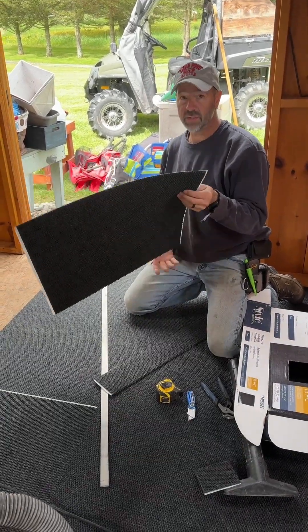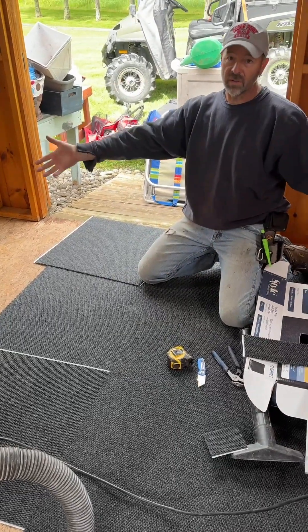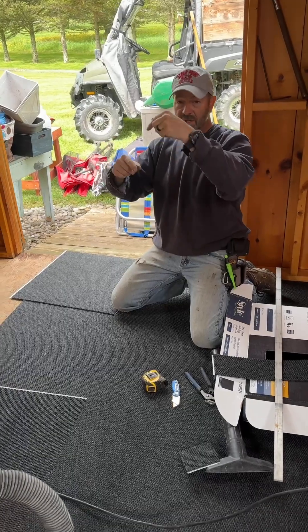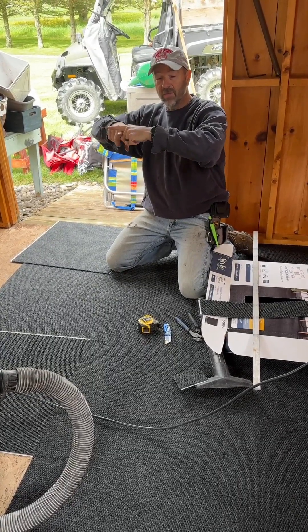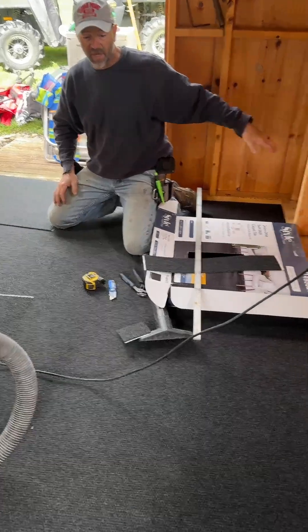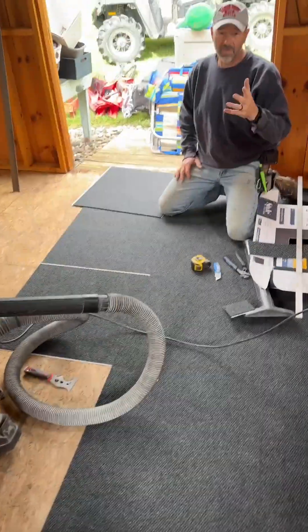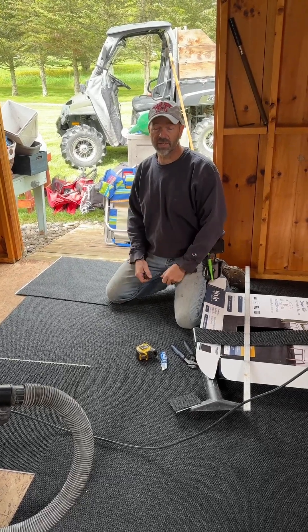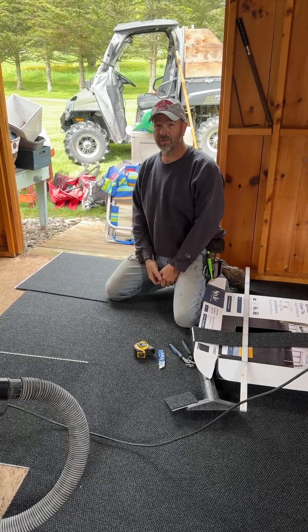We're laying straight patterns for simplicity, just to get it done quickly. You can find the straightest wall, but a lot of times it's better to lay the floor out from the center — we call it a crisscross in the middle. Find the exact center of the floor, measure in all directions, strike out some square lines, make sure you've got a good square cross pattern in the middle, and then lay your tiles from there. I checked the shed and it's good and square, so we're going right down the edge. We've centered the tiles from front to back to cover the door openings. You may want to lay a few tiles on the floor first to see what layout works best before you start installing.